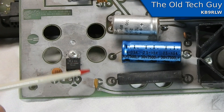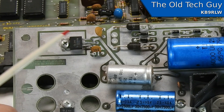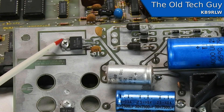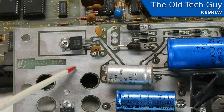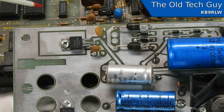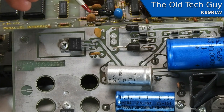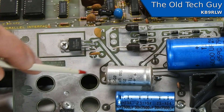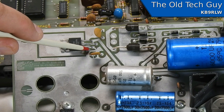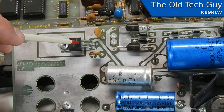This design is using the PC board as the heat sink. But on this one, you can see this cutout isolating this metal pad and the tab from the ground. That tells me that this has a different reference than the standard ground. In fact, the standard ground is its input — if you look at the input pin here, you can see that it has a trace that connects it to the ground foil. So the rest of the circuit's ground is actually the input to this regulator, and then its output runs up here to the negative 5 volt pin on the power supply. So this 7905 is providing the negative 5 volts.